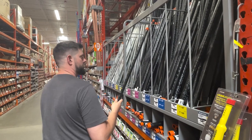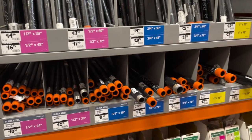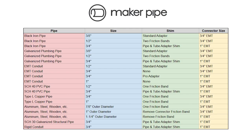Next, let's talk about some more expensive options that provide a lot of strength to builders. If you're making something really large and heavy-duty, I would recommend using black iron pipe, galvanized plumbing pipe, or rigid conduit. All three of those options are pretty expensive for just a few feet, but they do provide a lot in terms of strength and rigidity, and if your project really needs it, that extra cost is going to be worth it. Those pipe options come in a couple of sizes that work with our clamp-style connectors, so you don't have to worry about cutting and re-threading the pipes when building. For a full list of the sizes and pipes that'll work along with the shims that you need, just refer to that chart.